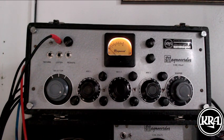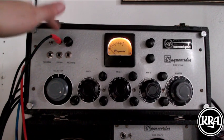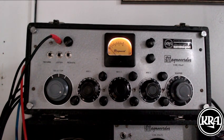And we have an output control that feeds the output we saw over here in the left panel. I've got it going into the left channel of an SP404, and then the left channel is coming out into this line level input. And over here on the side, I've got a switch that will process that signal as a TRS, sending the tip to the left and the ring to the right, and allowing us to set the level here. Or by flipping the switch to the other position, we can use a TS mono cable and send it equally to the left and the right. And for the SP404, for effects processing, that's how I have it set up.